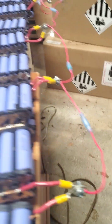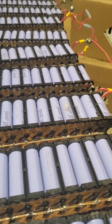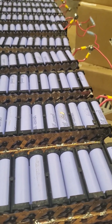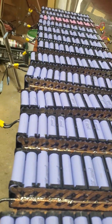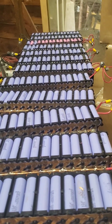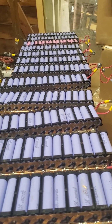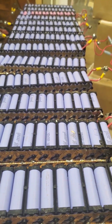I put all the positives together and all the negatives together. When there's a voltage fluctuation on each pack, you have to balance it by connecting negative to negative and positive to positive. Now you have a full pack, and balancing will take five to ten days depending on the size of each pack.